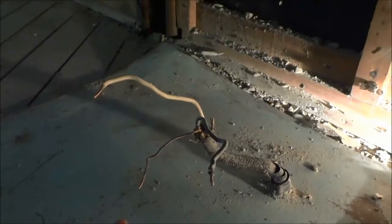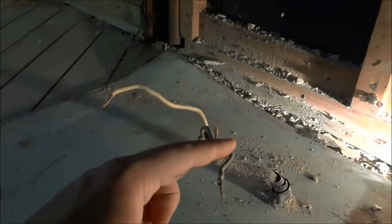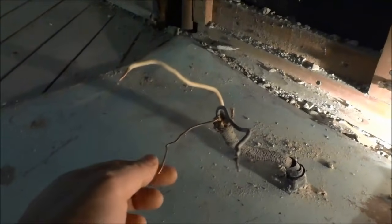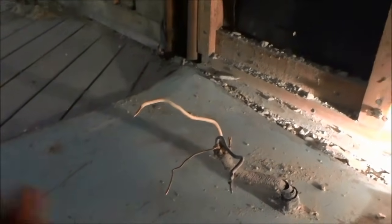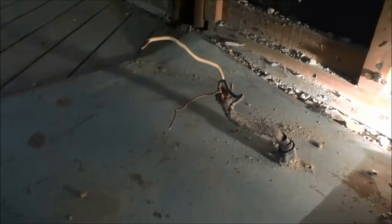If you take a look at these electrical wires right here, you'll notice that there are three wires. There is a white one which is the neutral, a black one which is the hot wire or the power wire, and then this uninsulated wire which is the ground. I will be using these wire nuts — or some people call them marettes — to cap off each of these three wires individually. Make sure that the wire nuts you are using are the appropriate size for the wires themselves.